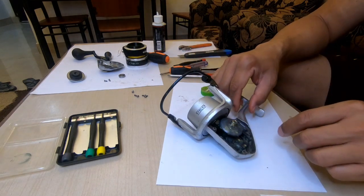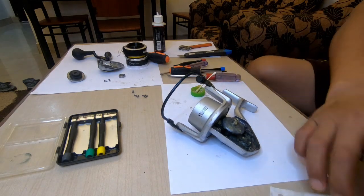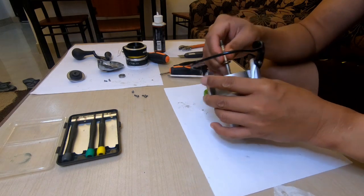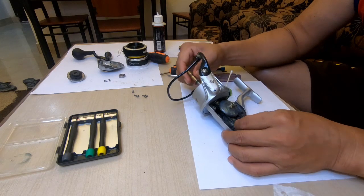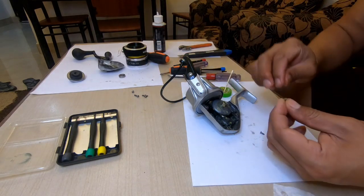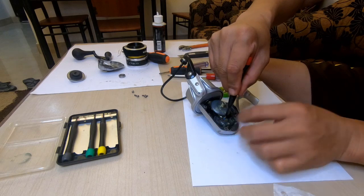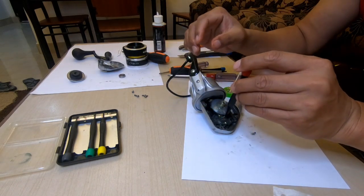After the main gear, the next thing you need to do is to put the shafting. Where's the shafting? Here. Put the shafting — apply a little grease. Yeah, it's there. Next, two screws for the shafting. Let's put it here. You know guys, this is very simple — the main thing.